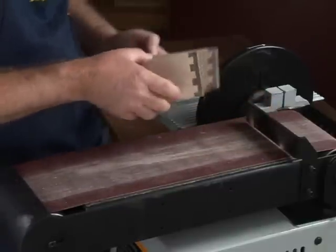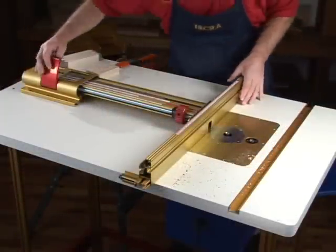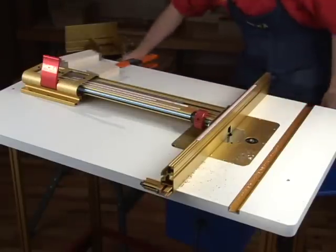From this point forward, all we're doing is using standard half-blind dovetail technique to join the four rectangles of wood. To cut the tailboards, we'll begin with the dovetail-shaped rabbets. Move the LS to a scoring pass position and lock the carriage in place.